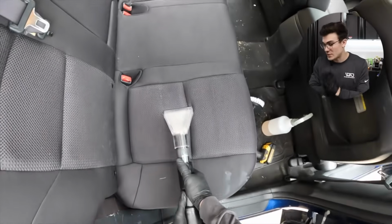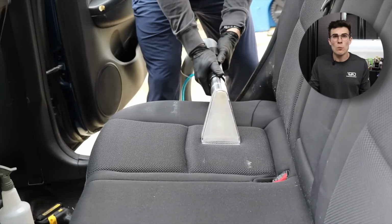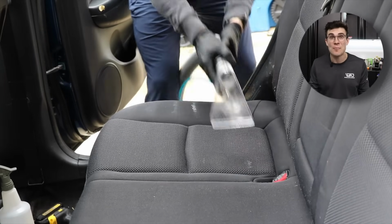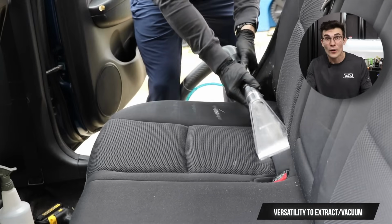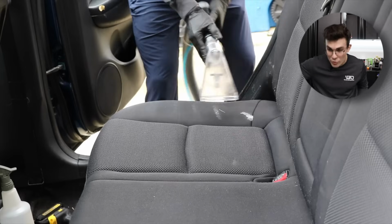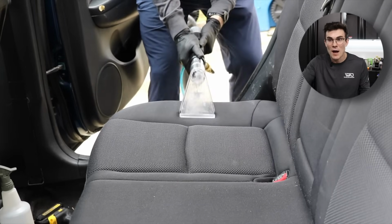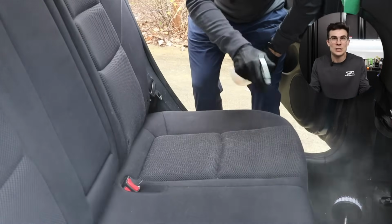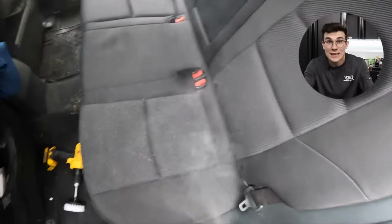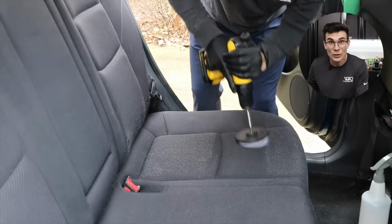Well, the obvious difference that I saw here is that this particular kind of kit head that I bought on Amazon comes with a really wide mouth, so you can suck up a lot of debris, and it's really easy to suck up the debris because you're mixing it with water, so you kind of loosen it up, and then it sucks through the vac hose, and then that debris with the water shoots out into my 4-gallon rigid shop vac. Well, this is just a vacuum, so there's no general filters in place. It's just going to the same kind of water basin reservoir that the regular dry dirt would go to if I was vacuuming.